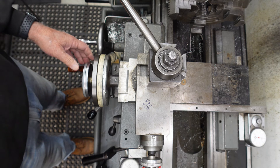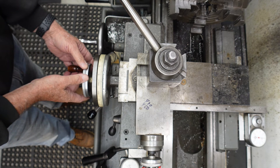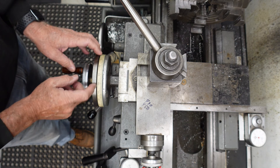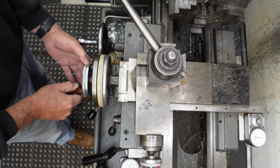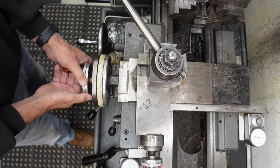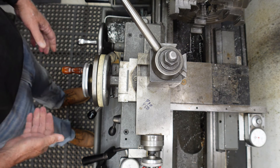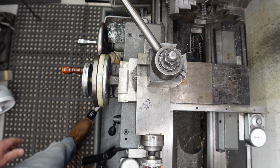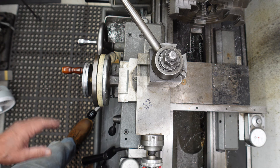And it's not zero, it's your number. If I'm cutting to a number of 50 thousandths here, when I come back I've got to go back to 50 thousandths if I want the same reading. I just had to share that — it's something that Chewy taught me a long time ago. And mentioning it to Joe, I hope people read the comments there. It's just a simple lesson on using the dials on your machines.